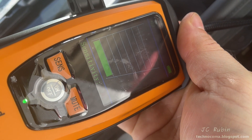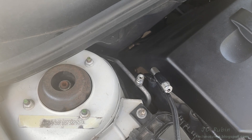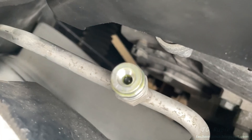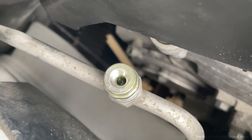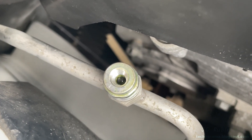Very important — I'm checking the low pressure fitting right here and I'm not getting anything. It is not leaking, which is very good. The high pressure fitting, however, proves to be a problem. These fittings are terrible from AC Delco — once you plug a connector to them they go bad. I put a little bit of PAG oil on there and we can see it bubbling. This is not good at all. This fitting needs to be replaced with a proper valve.